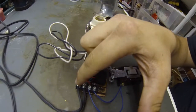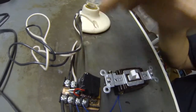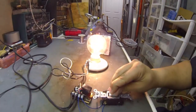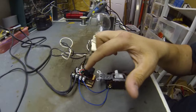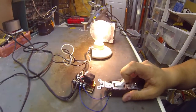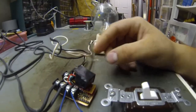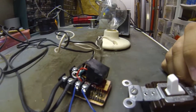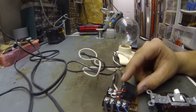We have inputs: the neutral, hot, and hot and neutral. It also allows you to attach to a switch — this is a digital input with a 3.3 volt pull-up on one side and the switch is grounded. The wireless part is an MRF24J40MA transceiver at 2.4 gigahertz.